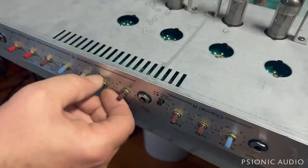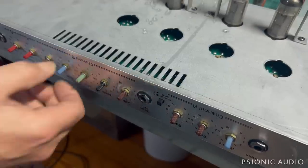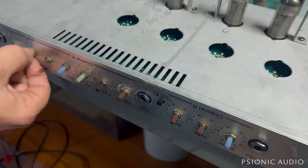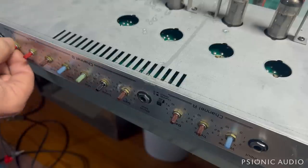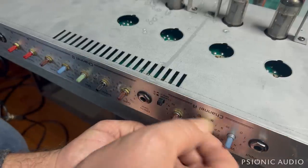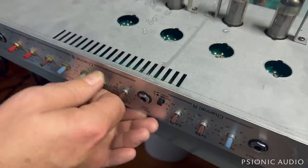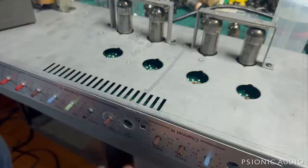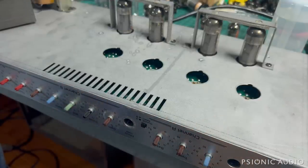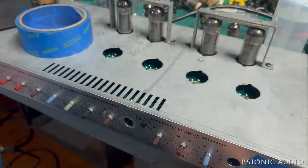I've got the knobs off. I promise I didn't come in and loosen these just to look like I'm doing something on camera, but every one of these nuts can be turned by my fingers — and that should never be the case. Every time that happens, all the mechanical stress of using the pot that's supposed to be borne by that pot-to-chassis connection is just borne by a solder joint that was never designed for that. With all the nuts off the board is just flapping, so I'm going to put a bit of blue painter's tape on it — it doesn't leave residue and will keep it from getting damaged.